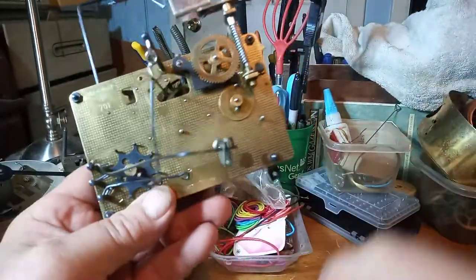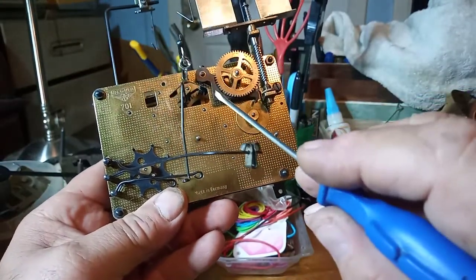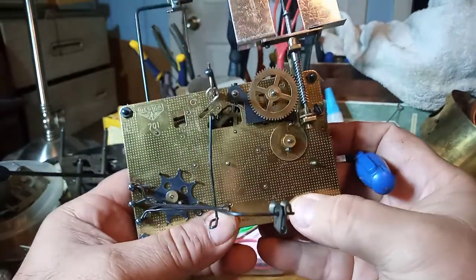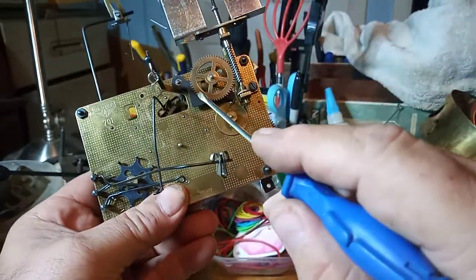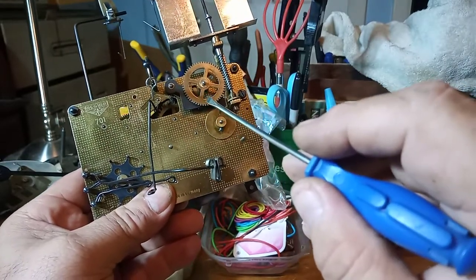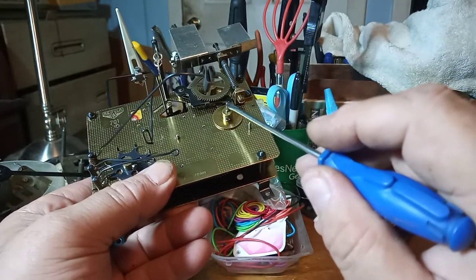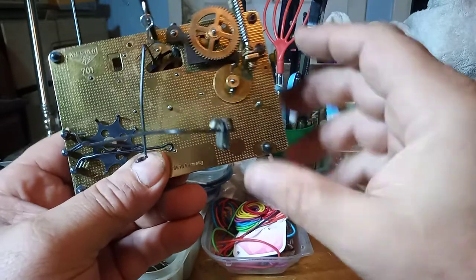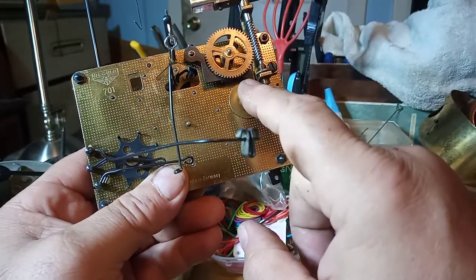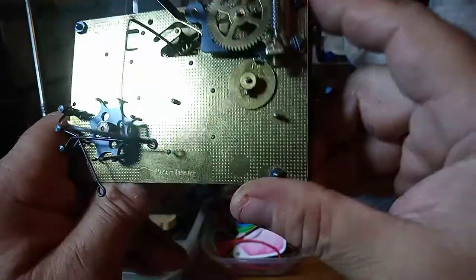The only thing, again, the only thing this black lever here does, you have to associate it with regular music boxes. This black lever is the wire on a regular music box. This pin is the governor pin on a regular music box. That black lever stops this wheel from turning as it's cuckooing.